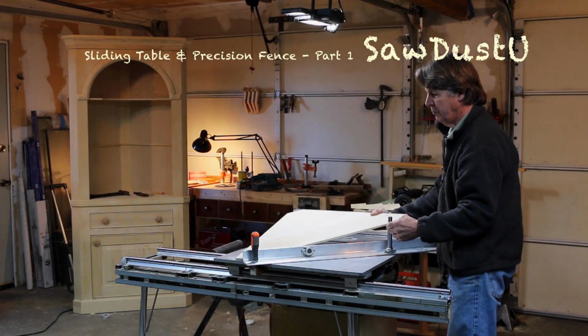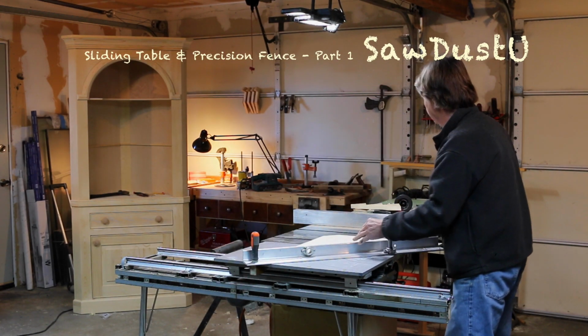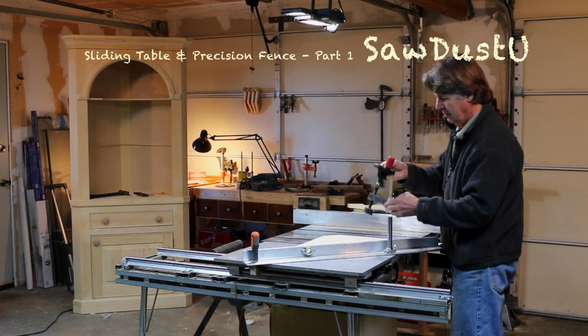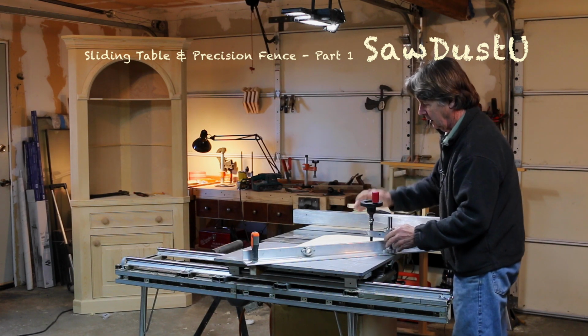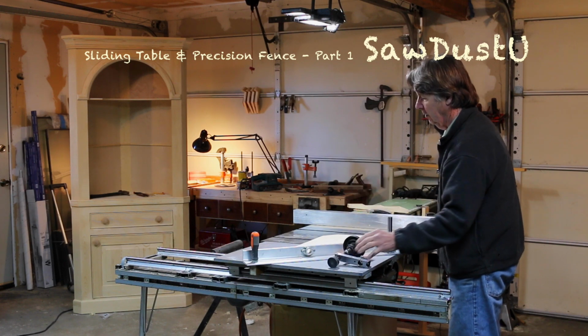You can then take this, put it on your sliding table, move your fence to 45 degrees, use your hold down, clamp it in place, slide it through the saw with total control.